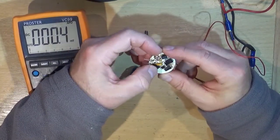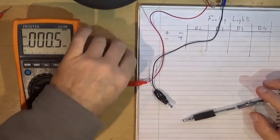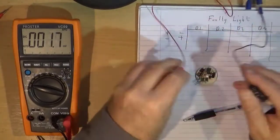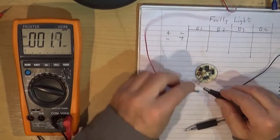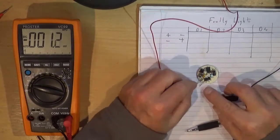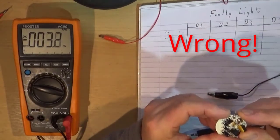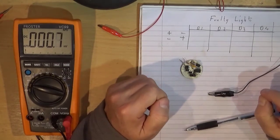The rectifier is those four diodes there. We have plus-minus and minus-plus — that means those are the lead connections. So that's plus-minus and that's minus-plus, and we have D1, D2, D3, D4, all the same way around. We're going to measure the voltages across those diodes both ways around and make a table.